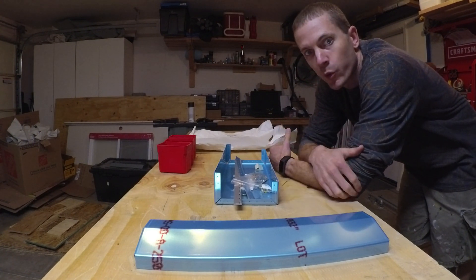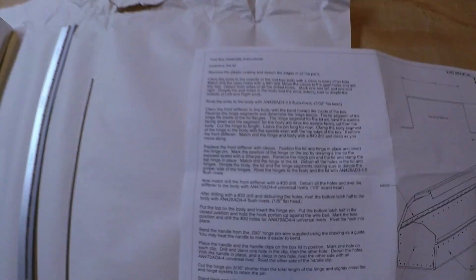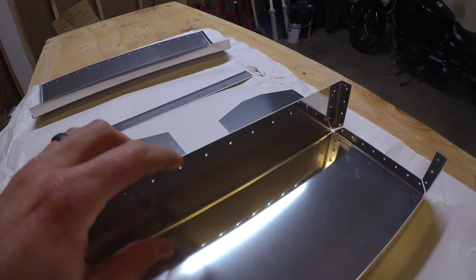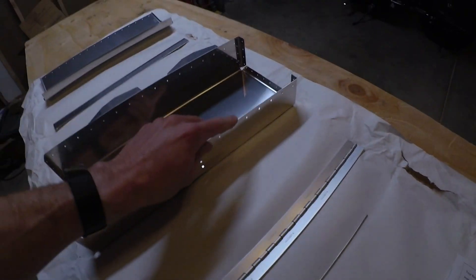Step one is just going through and inventorying all the parts, and then we'll get all this blue plastic material taken off. Looking at the plans here, we have successfully accomplished the inventory and removed all the plastic coating. So the next step — and this applies to most of the aluminum parts for the airplane too — is what's called deburring. All of these aluminum components are punched out of solid sheets and bent before they're sent to you, but they can have sharp edges or little nubs. You can kind of see this shiny spot on the edge if the light catches it right. If you've felt the edge of aluminum or sheet metal, you're familiar with those little sharp nubs. The fun part of deburring is doing all of the holes as well.